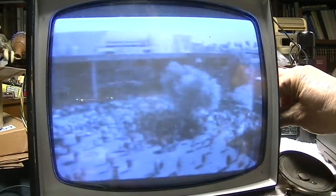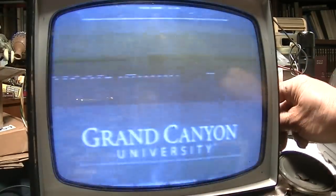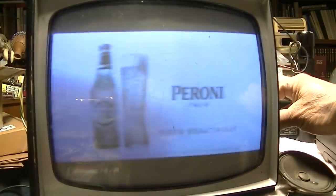So the rolling is still a bit of a problem, but it's decent. And this has a local DX switch on top of it. And that's on DX. If I put it on local, it's on local. If I put it on DX, it just completely overloads. And I'm watching the AGC voltage and it doesn't move. It's 7.14. 7.19, it just doesn't move. It's like the AGC is not working. The AGC should regulate the gain, and there is no AGC pot on this.